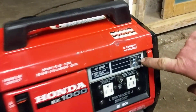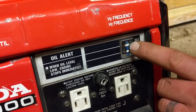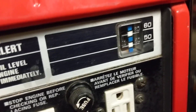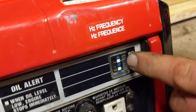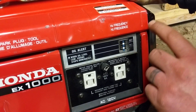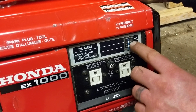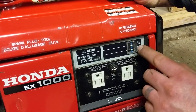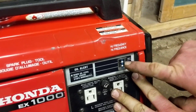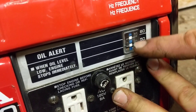If you can zoom in right there — you can see that white square is vibrating compared to the other two. These squares vibrate indicating the frequency that this generator is outputting. Here in North America you're generally supposed to be between about 55 and 60 Hertz. You can actually adjust the governor in or out to bring the vibration in between those two marker lines. You want to have that blue square vibrating when this thing is under load, so you need to set this when it's under load.